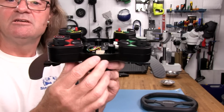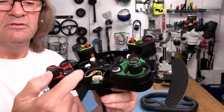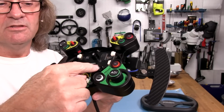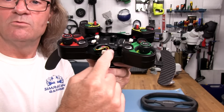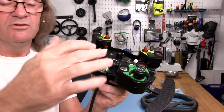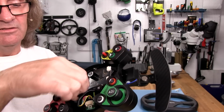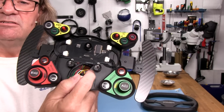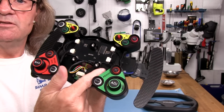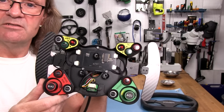First, in the aluminum housing, you can see that there are the standoffs that are very close to the wheel, as I said before, because those screws weren't very long. And of course, those are perfectly level with where it needs to be as far as the outside of this housing, so that when everything bolts down it's nice and flat and tight and gives it all the support it needs. When this was CNC'd out of that one piece of aluminum, these were left in for the standoffs for supporting the steering wheel, making everything very, very solid and stable.